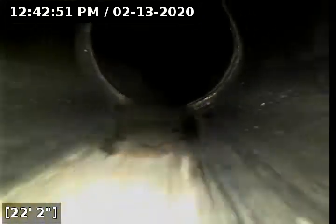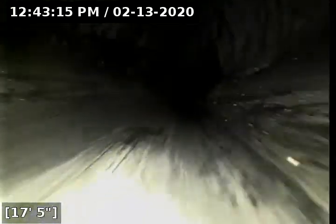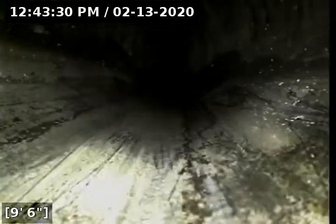With about 23 feet remaining. So there's two primary materials used for this sewer line. You have the ABS, which is what we're currently in, and then we have the clay, which I've already covered. So the transition between that is in the front lawn. With about 10 feet remaining, we are getting closer to the end of the sewer line inspection.